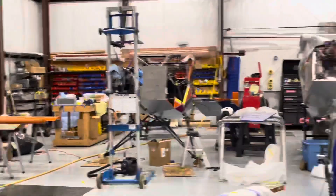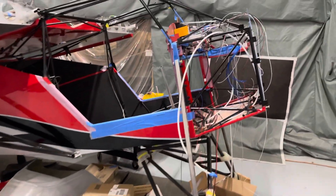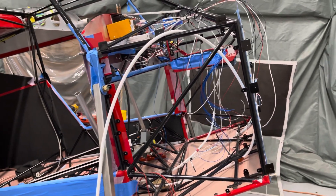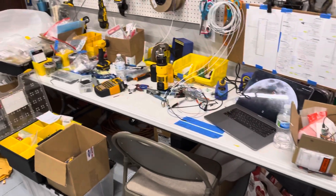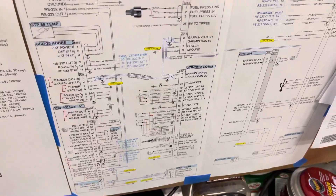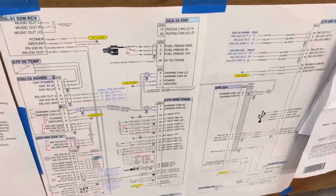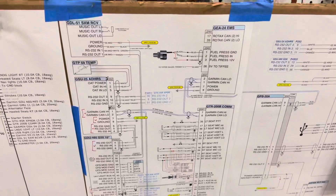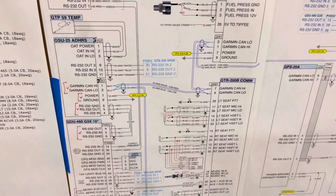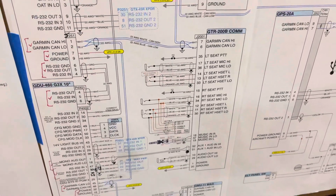Here's my update: a lot of wiring. This is where I've spent most of my time at the workstation, following this wiring diagram that I made in draw.io — super easy to do. It makes things a lot easier having it all planned out, being able to quickly reference what pins go to what, what color wire and what gauge wire to use, and planning the routes to see what connects to what.